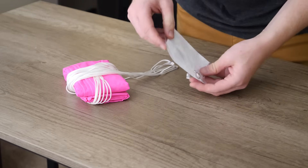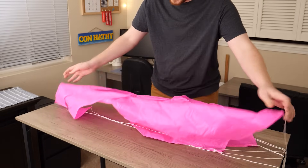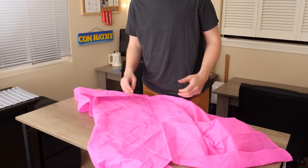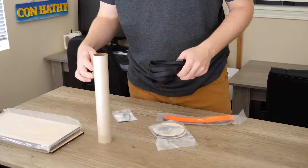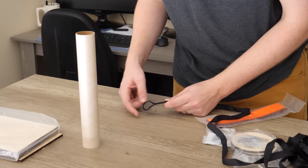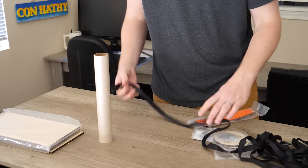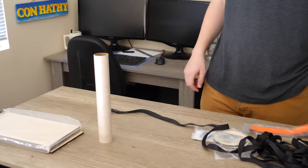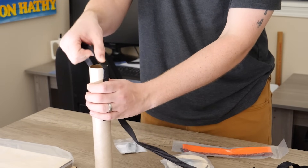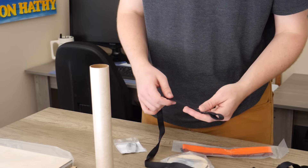For recovery I got a 60-inch Top Flight X-type parachute which arrived as an incredibly high-vis magenta — so bright my camera doesn't even know how to process it. This will all be tied together by an 18-foot tubular nylon shock cord. I went with sewn loop ends so I wouldn't have to rely on my knot-tying ability. I also chose a wide 5/8-inch cord to avoid zippering — if your parachute opens slightly too early or too late while the rocket is moving, it can snap tight and cut into the cardboard body tube. A wider, softer shock cord makes this less likely.